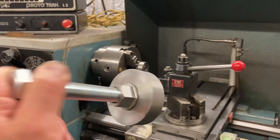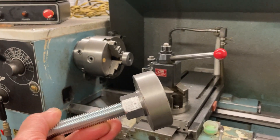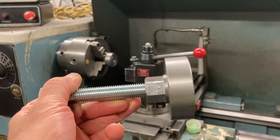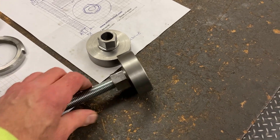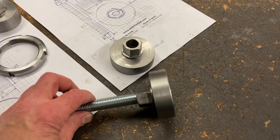It's a metal hub with a hex and a thread inside. We're going to cut an outside thread. This piece is an extraction tool. The big 65mm thread screws into something, and then they use this thing — screw it in, and as it comes out the other side, it bottoms out in the hole and pulls out whatever they're pulling out.